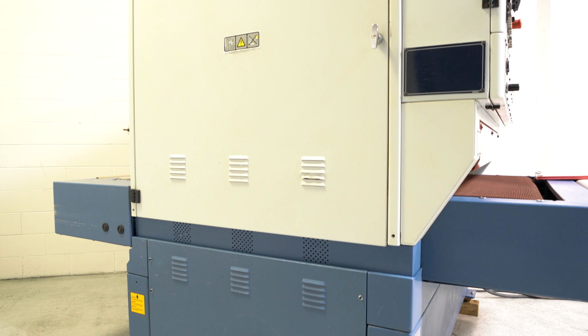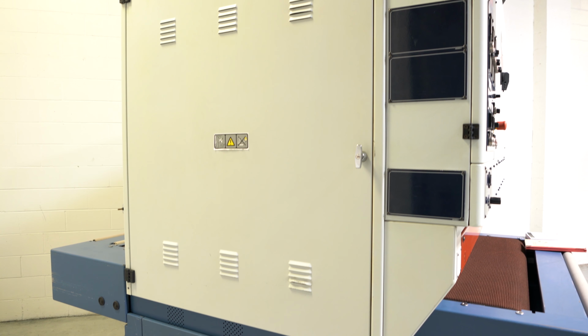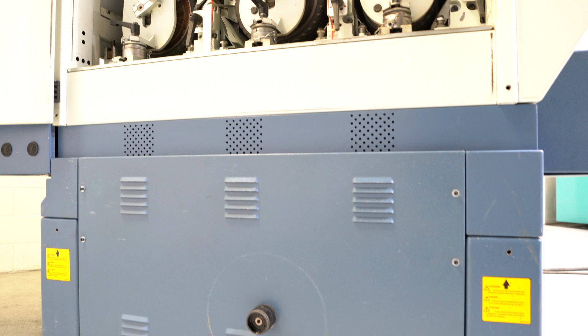We're gonna do a walkthrough of a CB 3-head 52-inch calibrating wide belt sander. This is an extremely heavily built, well-maintained 3-head 52-inch sander with a constant pass line, meaning the heads move off the conveyor while the conveyor has a 35-inch fixed height. All heads are deep grooved and defect free. You do have a 5 7/8 inch maximum thickness capacity. You do have pneumatic hold down shoes.